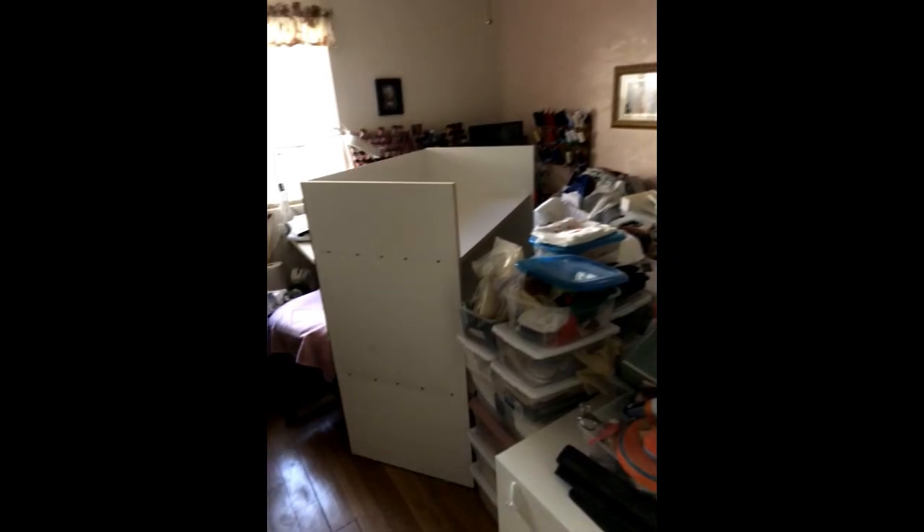The bottom shelf is 17 inches clear of the floor, which allows the sewing cart to fit underneath. The upper shelf I put six inches down from the top. The backing piece is 3/16-inch thick white gel-face hardboard cut 42 inches wide and 30 inches tall, set even with the top of the side boards and screwed to the back to stiffen the unit. I put some small nylon feet on the bottom so that it would slide easily across my bamboo flooring, and it's done.